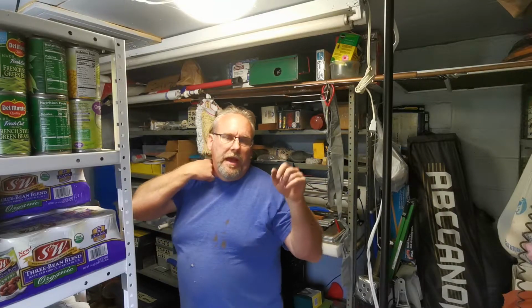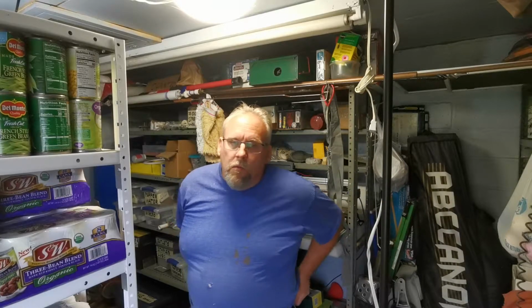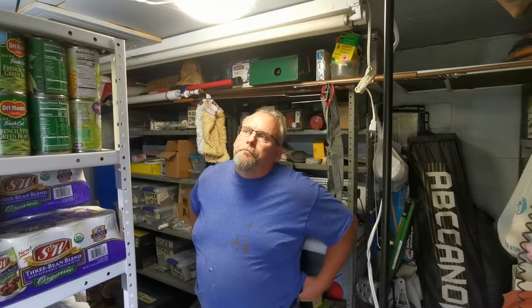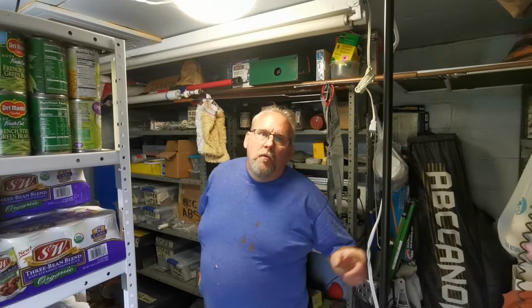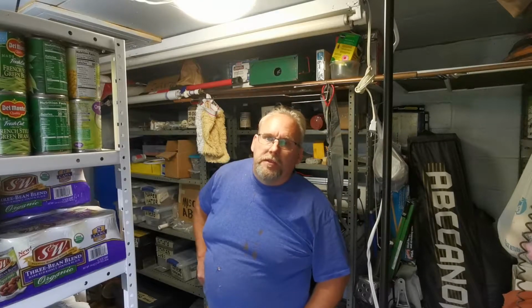The box doesn't have... I was hoping it had holes across the back, but it doesn't. It's got two on one side, and then a service hole on the top, and then two on the other. And so once I get up to the ceiling, we'll have to bend the conduit slightly to get it up against the wall where I want it.